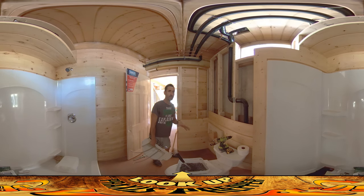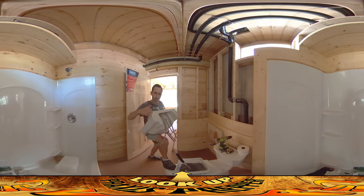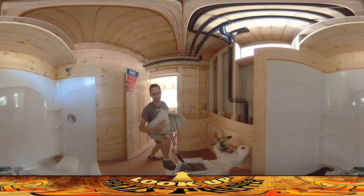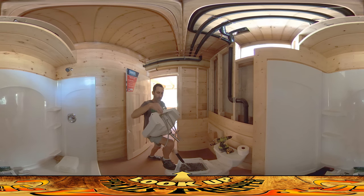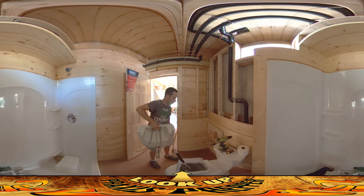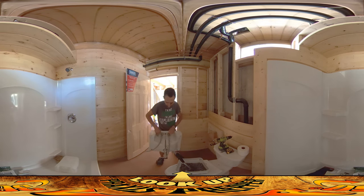I thought I'd do a second video for today because something came up that I didn't know how to do right off. I asked the plumbers about it and they were able to instruct me as to how to mount one of these sinks. These sinks have got a couple holes up here and a couple holes here. The plumber said the way these mount is with a bracket that grabs onto this ridge right here. So I created one — I already have it on the wall. I took a 2x10 board and made these little pieces of wood that come off of it with a little notch in the back that corresponds to this ridge.